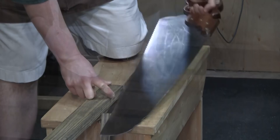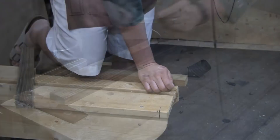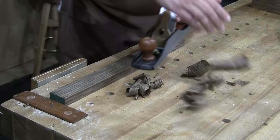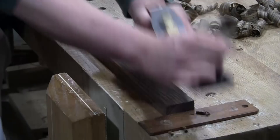To demonstrate that, I'll flip this around and cross cut these two pieces to 21 and a half inches long. Now I just need to size these to their final dimensions and I'll use my jack plane for that. I've got to joint both edges and plane the faces and get them down to my final size, which would be about seven-eighths of an inch thick, two inches wide. I'm not going to worry about the length at this point because I need to cut some tenons on the ends.